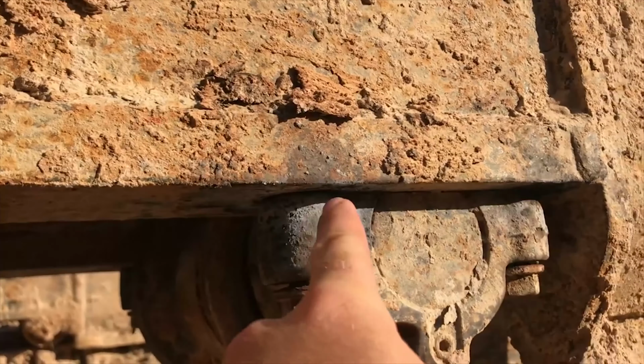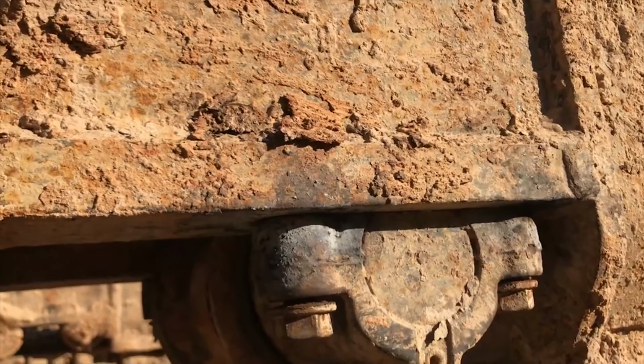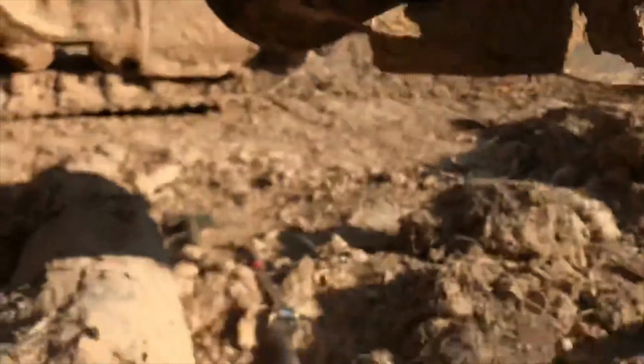So I was putting my heat right around the base, and like I said, I had to heat every one of them, but once I did, I was able to break it loose with just a 16 or 18 inch ratchet. I heated them and then I smacked that steel plate with a 4-pound hammer just to shock it. That will help a little bit too sometimes. So I had to heat and smack all of them, but I've got them all broke loose.